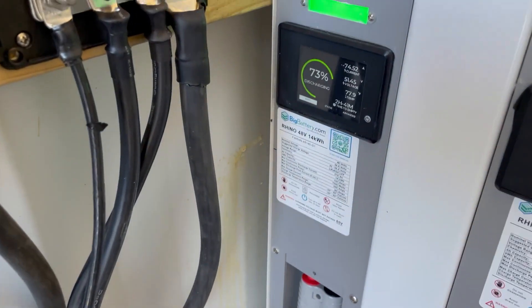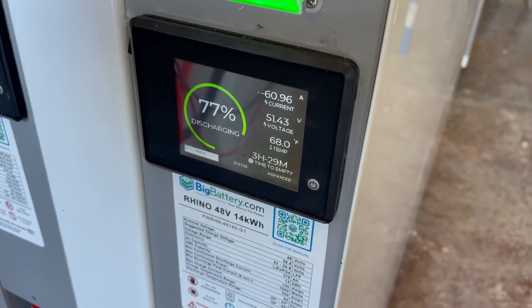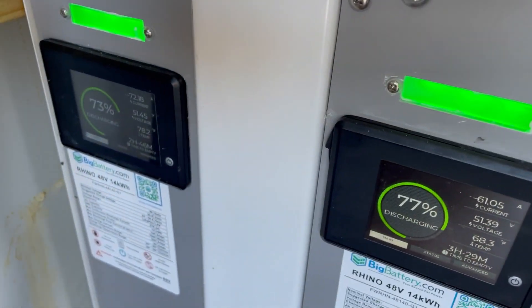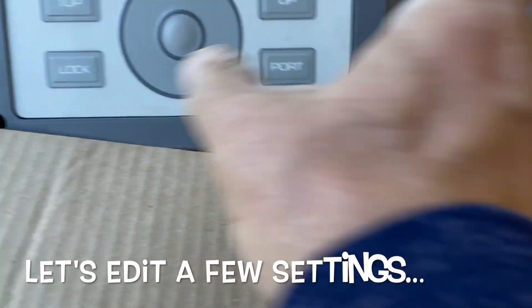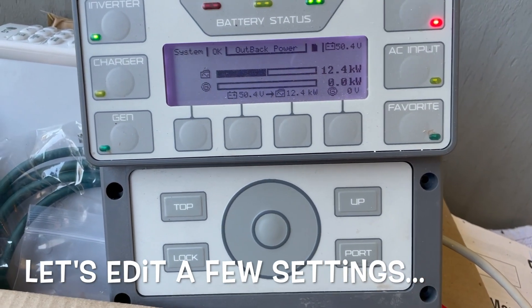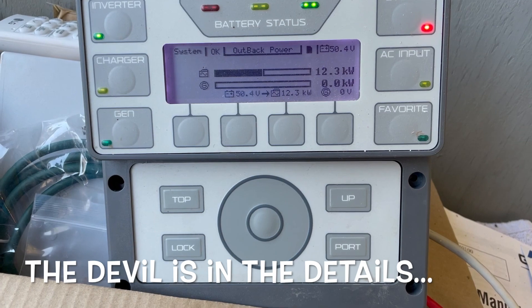Doing a big load test — I think it's about 11 kilowatts. We're taking 70 amps out of that one, 60 amps out of that one, 60 out of that one, and 62 out of that one. They're all at different states of charge since we haven't finished a full charge cycle yet. The Mate is showing 12.3 kilowatts — that's a pretty good size load for this battery system. The generator is turned off so it won't start under this load. A bit more programming and we'll be back on track.